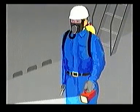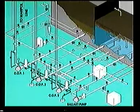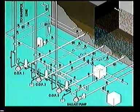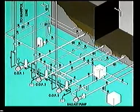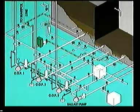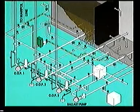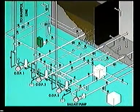With the cargo tanks clean and gas-free, a few tasks remain to be done. The slop tanks have to be decanted of clean water to the sea by gravity at first, and then by the stripping pump. All slops have then to be collected in the starboard slop tank. The port slop tank should be washed with seawater, which is stripped to the starboard slop tank with the stripping pump. Since there is a lot of sediment in the bottom of these tanks, it may be necessary to clean the bottom for 3 hours. The cleaning takes a total of 4 hours.